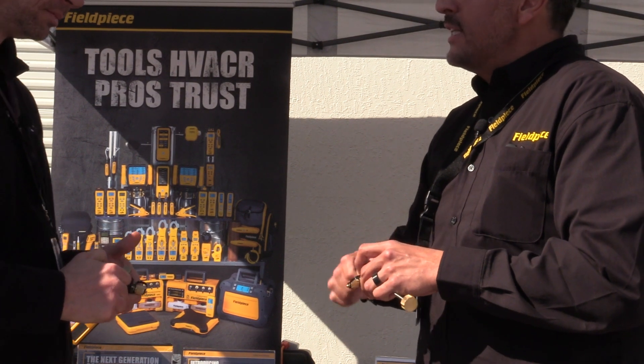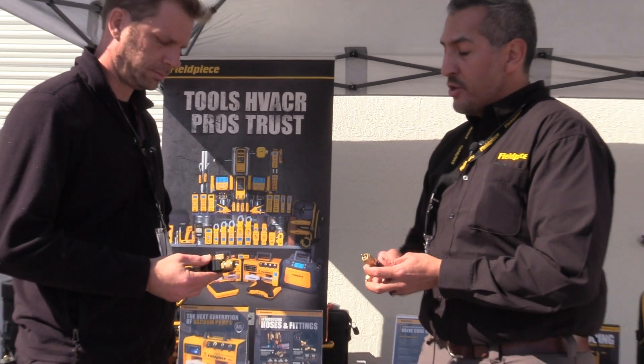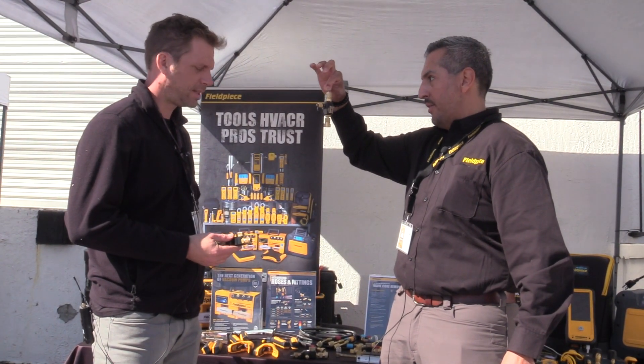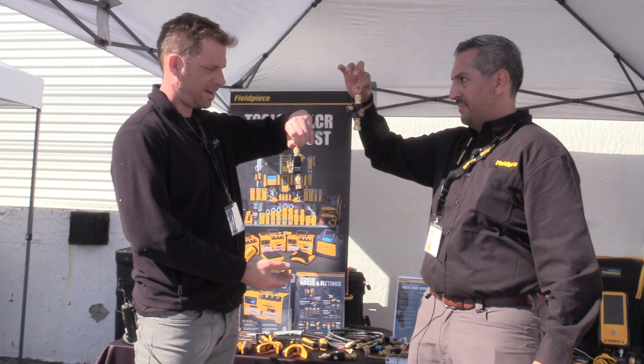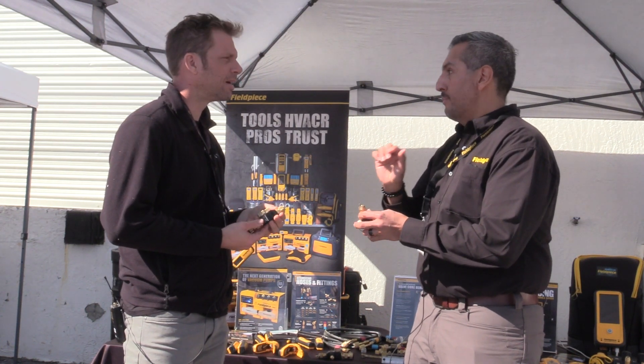You could have one tool, and your five-sixteenths fitting can just screw right onto it to go onto a mini split. Instead of making it longer with an extra extension, you can unscrew it and keep the size of your tool. That's huge. Secondly, we've actually made the capturing mechanism a lot better so that you don't drop it in the tool. It can actually hang on the valve core — you can hang it up on camera. We've improved that capture mechanism so it'll never come out once you get it.